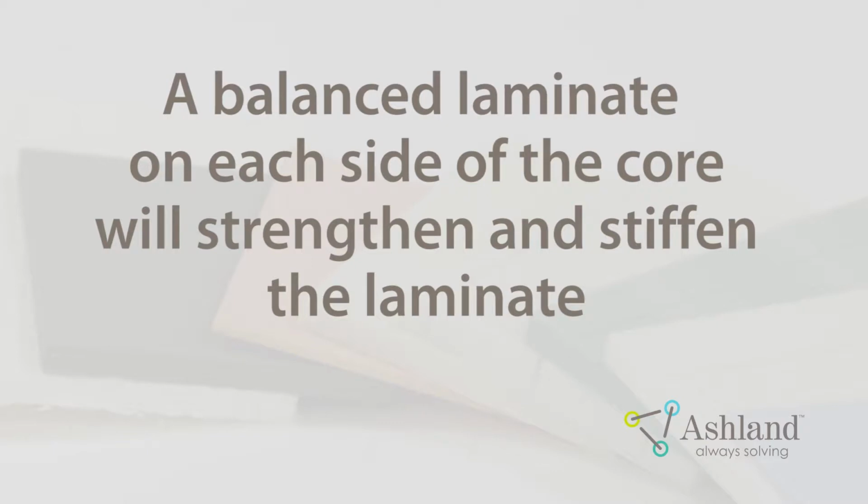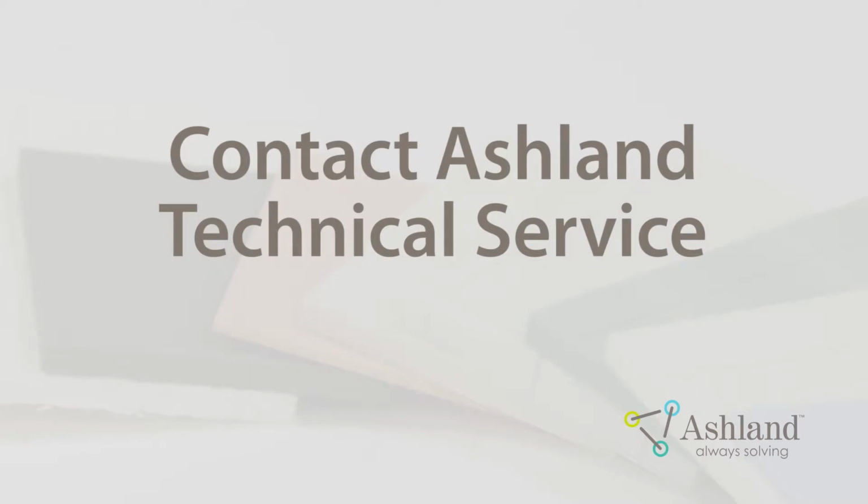Using a balanced laminate on each side of the core will strengthen and stiffen the laminate and produce the best results. For guidance to properly wet out or bed core materials, follow the best practices recommended by the core manufacturer or contact Ashland Technical Service.